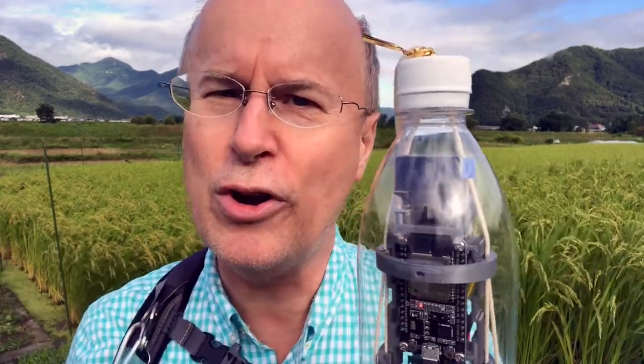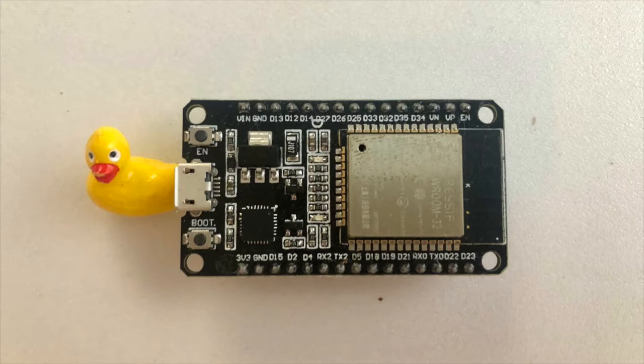So now in this troubleshooting journey, the next thing to try is: is this microcontroller board bad? Did I get a bad one? The boards I've been using are generic boards based on a design from the microcontroller manufacturer but made by random factories all over China, so perhaps this is a bad board. I'm going to have to load the same software onto a different MCU board and see if it eventually fails in the same way.